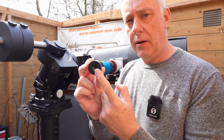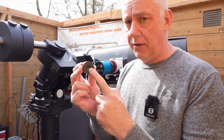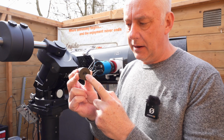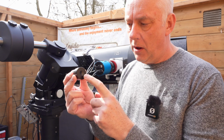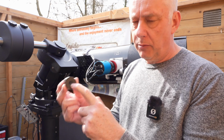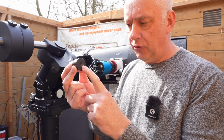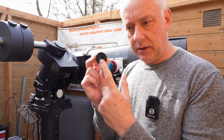It's difficult to measure. Essentially, this encourages you to get your eye very close to this and really centered, and this then improves the accuracy of this solution. So you want a Cheshire eyepiece from not necessarily Takahashi, but a good manufacturer with a small peephole here, somewhere around 1.5 millimeters, would serve you well, and you'll be able to collimate any telescope with this.